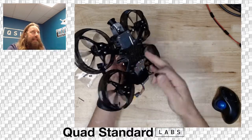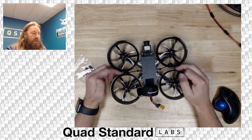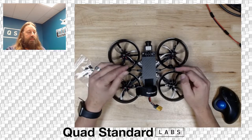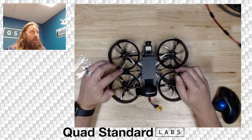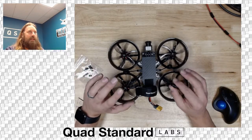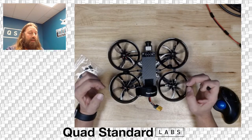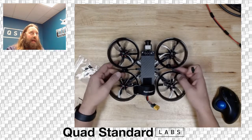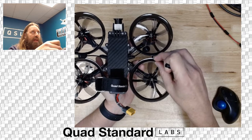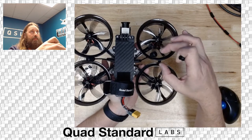Now, the last key to this is once you install the props, you're gonna wanna install little 3D printed spacer guides. We'll also provide this in the link in the description from our Thingiverse. We use a different one than what Andy offers, mainly because we found some small variances that the ones Andy makes are just very specific and the gaps have to be perfect. With these, you can actually align the ducts and you can move it a little more centered or a little off center in order to make sure that you're not pushing the ducts away and closer to the props.